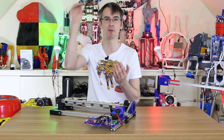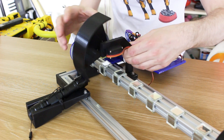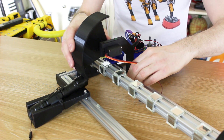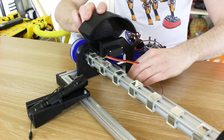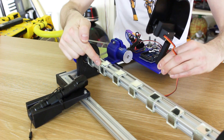What I'm actually going to do is put mechanical shutters on a servo. It basically sits above each laser, with a radio control servo, and each one has a shutter that can winch back. We can adjust the position of those servos for the seven frequency bands, and that will actually shutter the laser line being reflected off the mirror.